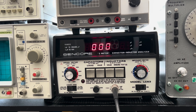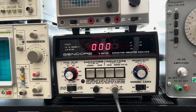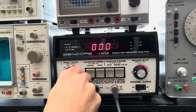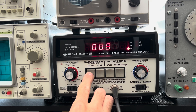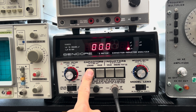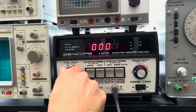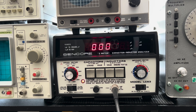The other 0.1 - let's check it out. I'll store all these at 200 volts. Value should be 0.1 - nice. Leaking, yes or no? 200 volts - no. 400 volts - no. 500 volts - no. 600 volts - no, not really. Awesome.